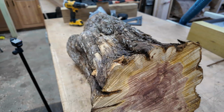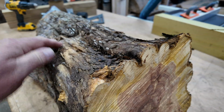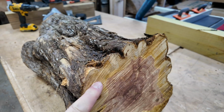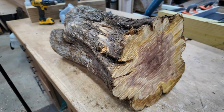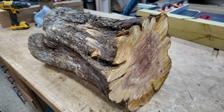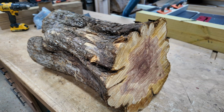I'm looking at the configuration of the bark. I'm thinking I want to keep all this on the outside of the bowl. Probably strip off all of the loose bark, get back to the wood itself, and hollow out this bowl. I don't know, I've never tried this before, but I'm going to give it a go. So I'm going to get it on the bandsaw first, just to cut a lump off, and mount it on the lathe with the screw chuck, and start some work on it. Follow me.